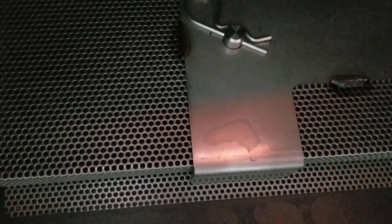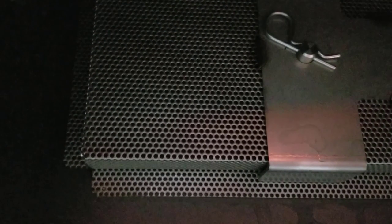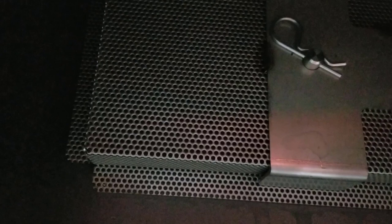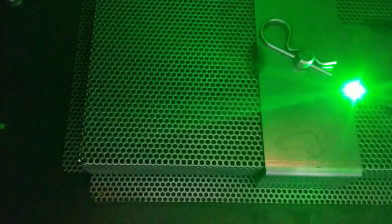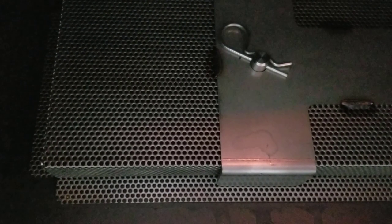If you look closely inside, you will also see that there is a stainless steel mesh filter. That mesh filter must be cleaned as well with the hose assembly. At least once a week, go ahead and remove the cotter pin located right there — the entire screen assembly will come out and you'll disconnect the hose assembly hooked to the end. That's what evacuates the tank, so clean that stainless steel filter assembly with water and make sure it's completely free of any debris. This full removal should be done about once a week, but in its current position you can clean it quickly every day when flushing the machine.